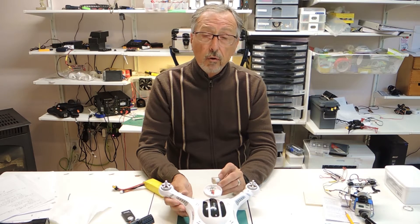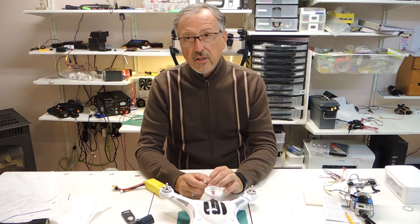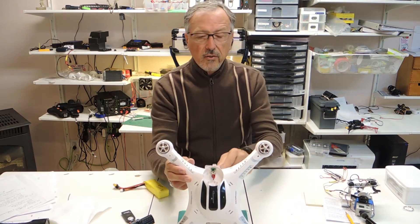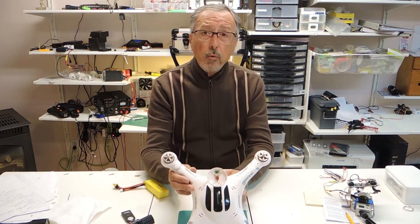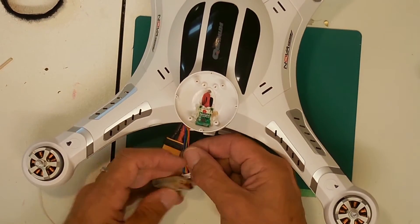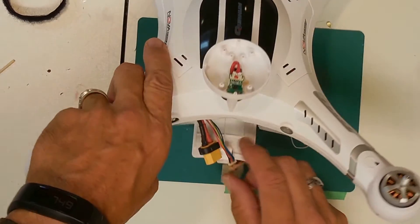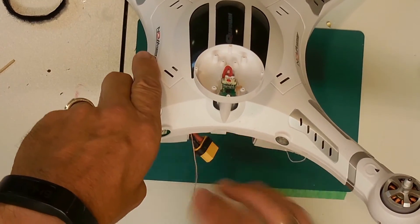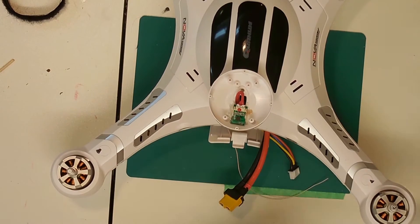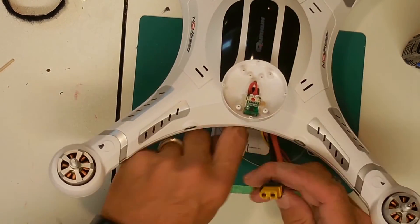The T Beacon has a battery so you don't need external power, but when you do apply the five volts to the voltage lines on this unit it will recharge the battery, extending your time. So when you crash, your run time will be whatever it was when you crashed. Before plugging in the main flight battery, I recommend plugging in the T Beacon first. I'm plugging in the T Beacon now and tucking it away inside the case — every craft is different but you'll always have room to tuck things away. Then I put in the flight battery. Before plugging in I turn on my walkie-talkie, the Baofeng UV5R, then plug in my flight battery.